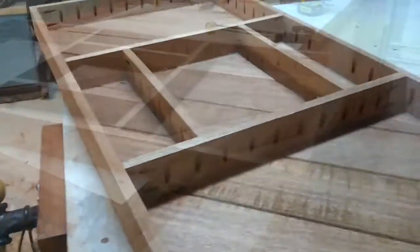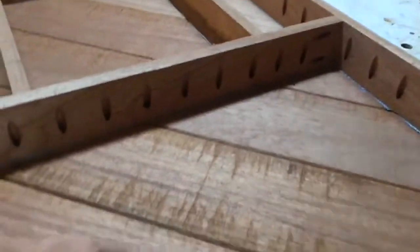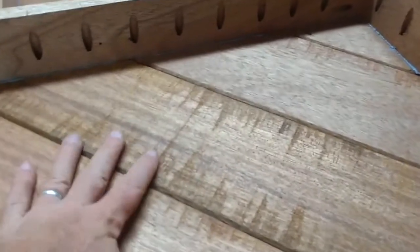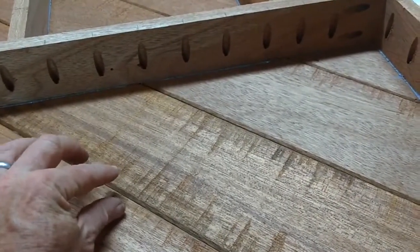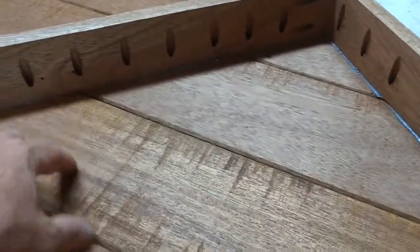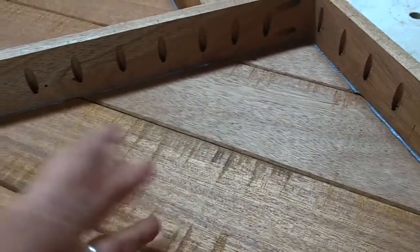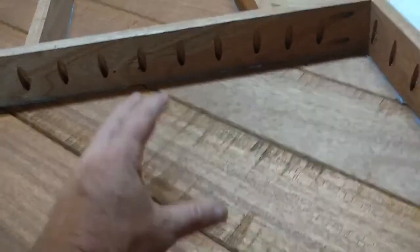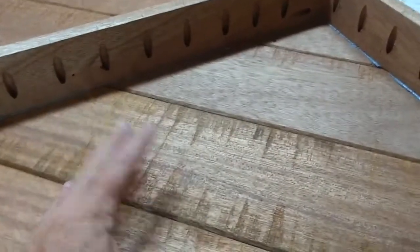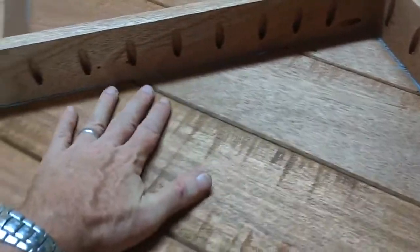They'll be latched together with buckle straps. Regarding the cornhole hole, it's going to go right here — a six-inch diameter hole. My concern is that these tongue and groove boards might be a little flimsy because you've got the hole here and these edges would be unsupported. After a lot of use, since you're going to hit the edge of that cornhole almost every time, it could become loose and flimsy. So I'm going to reinforce the spot where the hole is going to go.